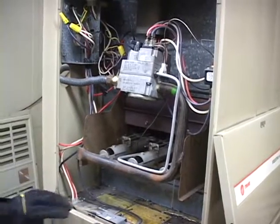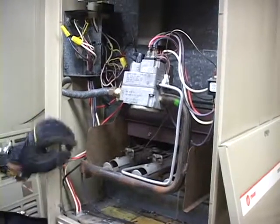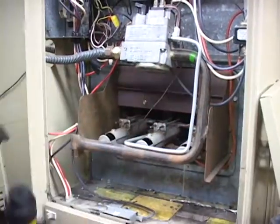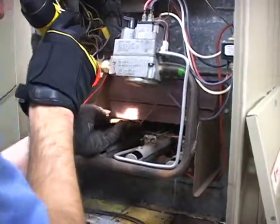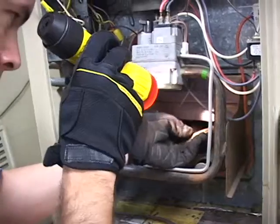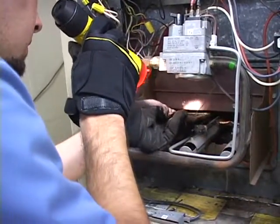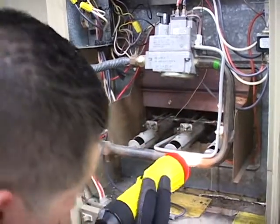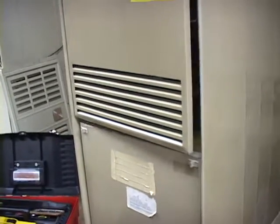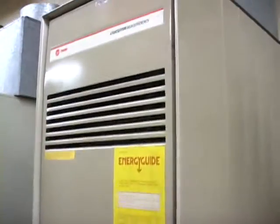After we replace the blower panel door, we go ahead and do a quick visual inspection of the firebox, looking for any ruptures or cracks. This is also called a cold check because we are checking the appliance before we put it into operation. Visually the burners look good. Once we're done with the inspection, we'll put the upper panel back on, and that is a complete service inspection.